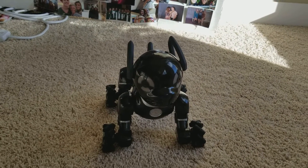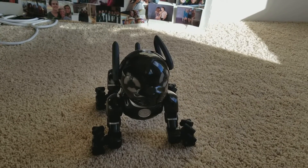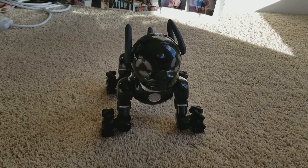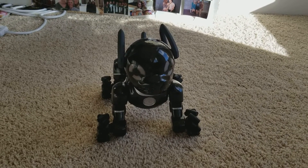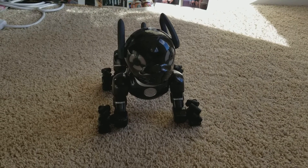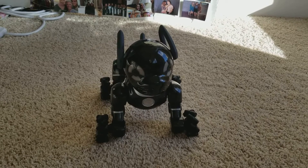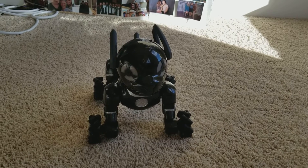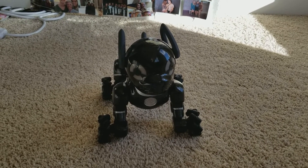So how I fixed it is I basically removed the harness from that part of the leg going to that motor, and re-soldered it onto the back of the harness for the left leg's wheel. So I've got it working, it can drive pretty normally, it just dances kind of funny because its leg is connected to the wrong wheel, but I was still able to get the motor spinning and working that way. I'm also looking to get a few other broken Chips and fix them by re-soldering that part of the leg, because it was a pretty fun fix seeing what they look like on the inside.